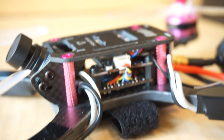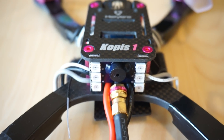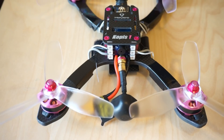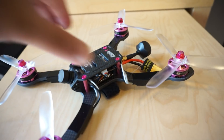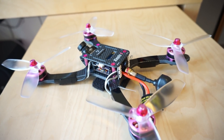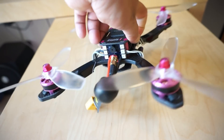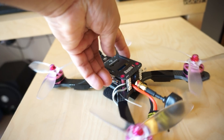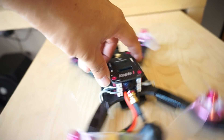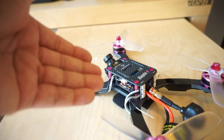You can tweak PIDs right there on the field using your radio sticks and the built-in OSD. At the back side of the quadcopter you can see the LED board and a beeper. You can also see the antenna placement — it is right at the back in between the two arms under the propellers. The video transmitter in this quadcopter is switchable for power: 15, 25, 100, 200, 400, and a maximum of 600 milliwatts, so you can set the output power of your video transmitter according to the rules and regulations of your country or FPV racing contest. And all of this is done using your OSD and radio control sticks — no buttons to find anywhere.